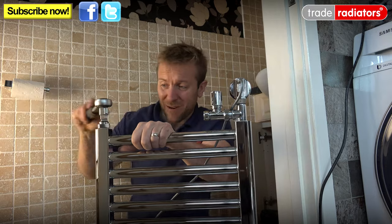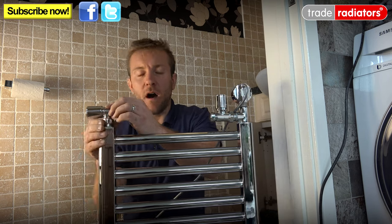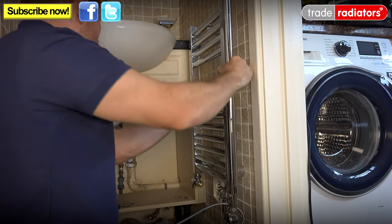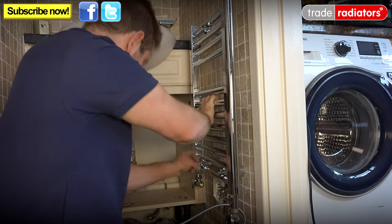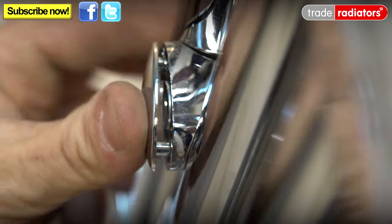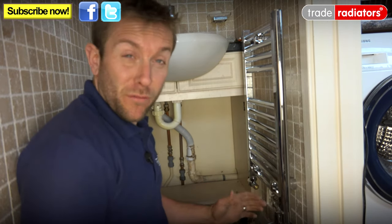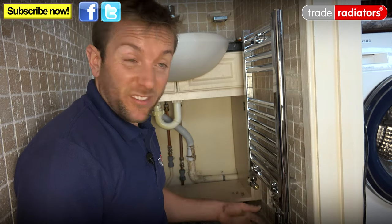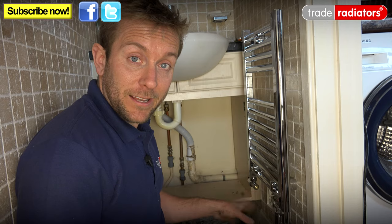Otherwise sometimes you get them the wrong way around and it won't flow through the radiator, or it'll make a horrible noise. So we've got them both pointing at each other nicely. Now I can hang this radiator on the wall and think about actually piping it up and making it look nice. Now that the radiator is hung on the wall and the manifold is all in, what I'm going to do is cut the wire back for the element but not wire it in yet — not until we've done our copper pipe work and got everything running. Because if we've got a leak and have to take it all out, it's just another thing we'd have to redo. So now I'm going to pipe up this beast.